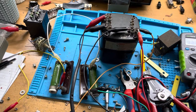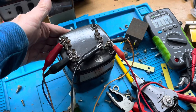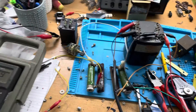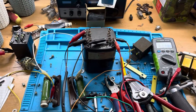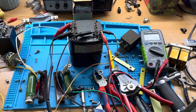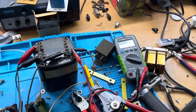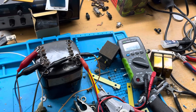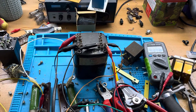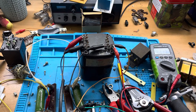I'm going to leave this on for a few minutes — be careful here because there's obviously high voltages around. But that transformer isn't even warm — it's stone cold — and that is way over its rating. I tried this test before and left the transformer on for quite a few minutes and it didn't even break a sweat. So if you're prepared for the slight voltage drop — which once you rectify and filter you'll get a few more volts out of it — this transformer would be quite capable of being a main HT transformer.